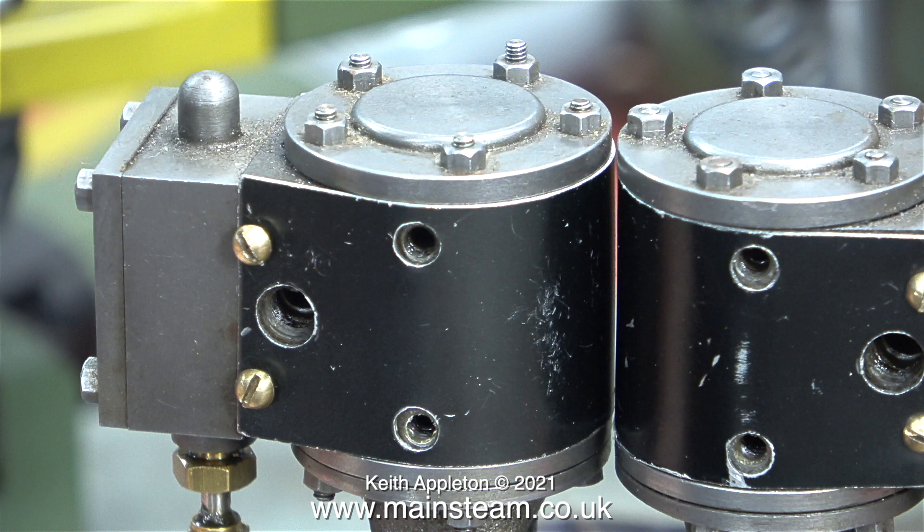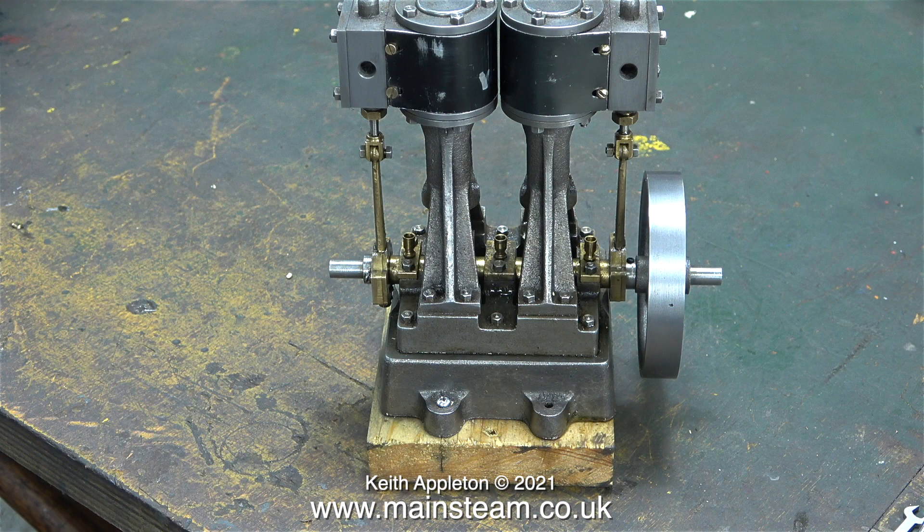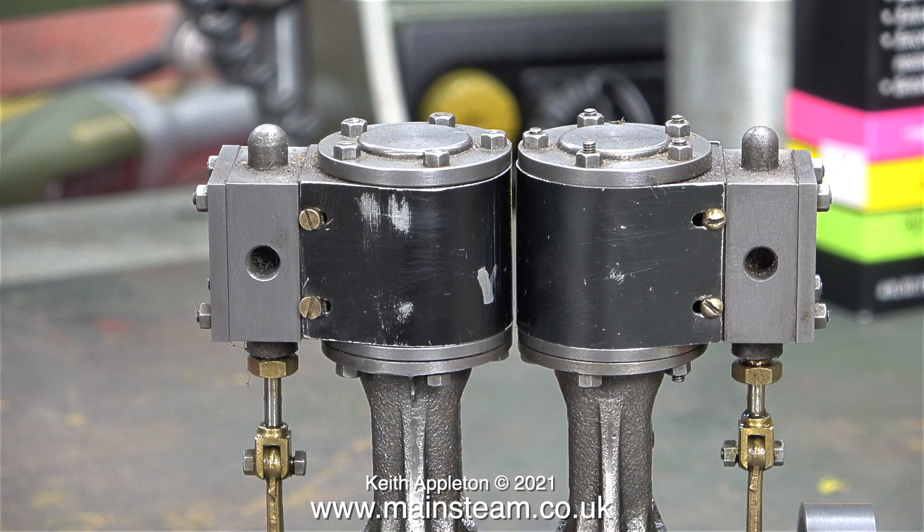By very carefully using my belt sander I'm going to trim the cladding so it fits perfectly. Once I trimmed it I temporarily fitted all of it to the engine using a variety of small 6BA bolts that I have, and as you can clearly see the cladding is definitely a better fit than it was. I temporarily left the cladding in place but I will be removing it in order to rub down both parts and repaint them.